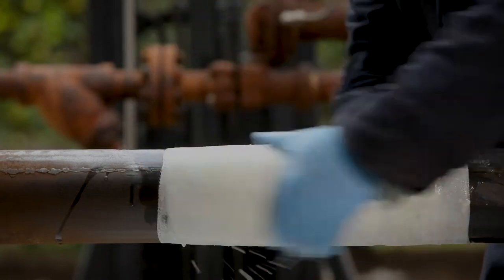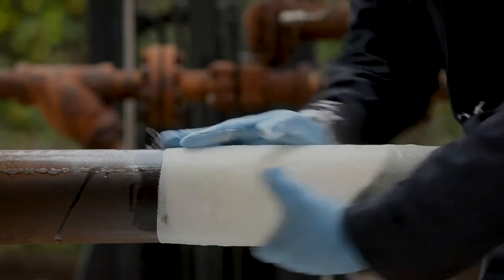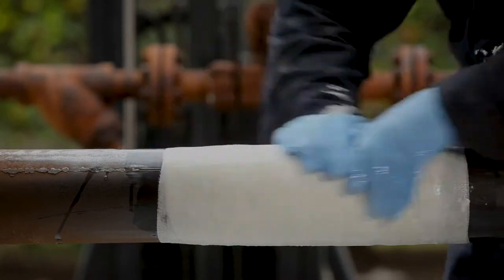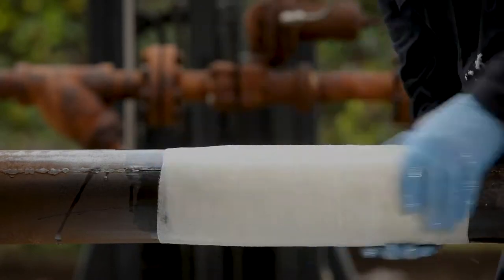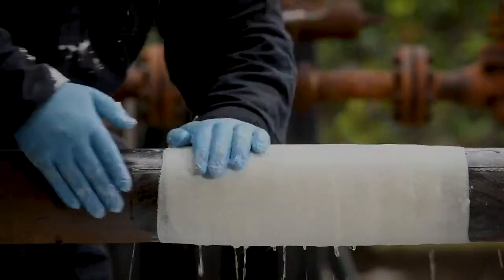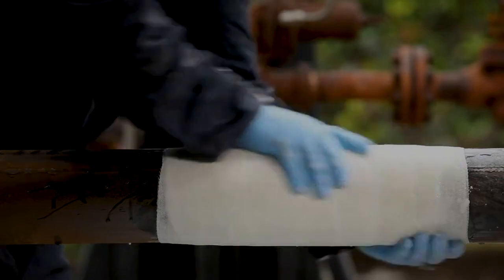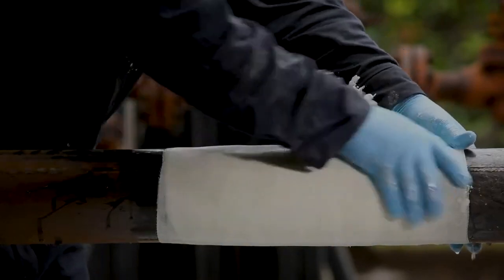Wet gloves and begin to compress the wet expanding resins back into the fiberglass wrap by rapidly and firmly stroking the surface, always in the same direction that you wrapped. Keep your hands moving quickly and wet gloves frequently. When the wrap stops foaming, rub and polish thoroughly. Continue polishing until all foaming has stopped in 3 to 5 minutes.